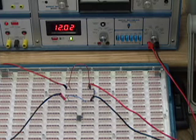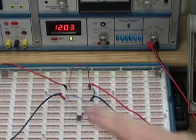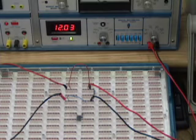If I put another resistor in there, I put a light bulb in there, that rule goes away. The voltage drop will be different for each individual one, but it's definitely not going to be whatever the voltage power supply is. So, this is how we take a basic voltage measurement.